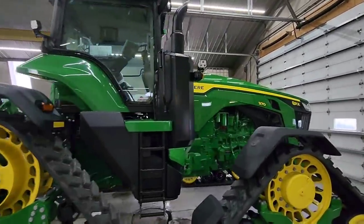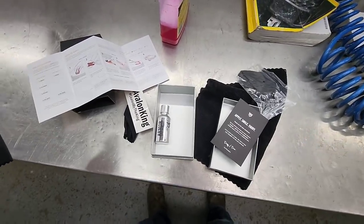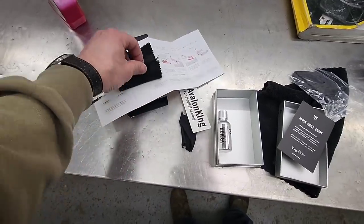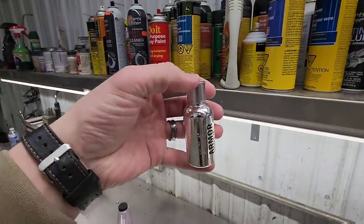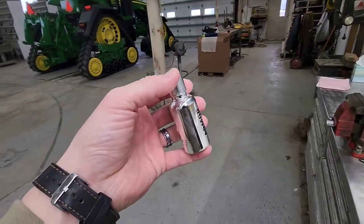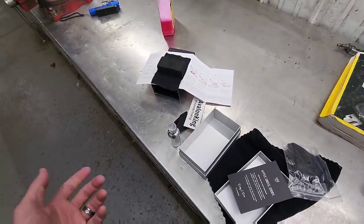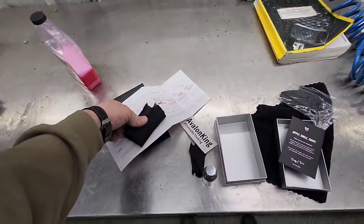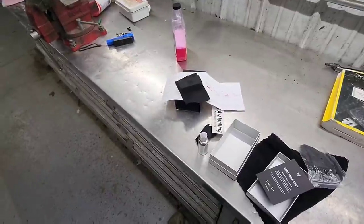I am back from lunch. Our tractor is dried, it's clean, it's beautiful. Let's make it really shine. We're ready for our ceramic coating. We've got this fancy little applicator sponge with a cloth that goes on it. The coating itself — I don't know, it was like a $35 bottle when I bought it, and I've had it for quite a while. This is what I have left of the three kits I bought initially. Should be plenty to do this tractor at least once, maybe twice. It's super easy — you just put some drops on the cloth, wipe it on in a crisscross pattern, let it sit for two or three minutes, then buff it off. It's a lot easier than wax and a lot better.